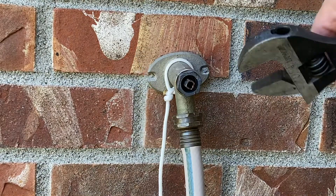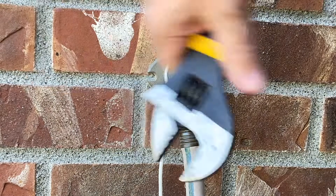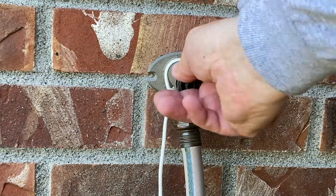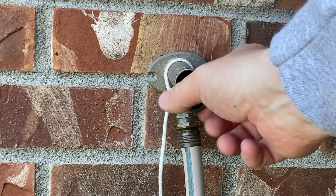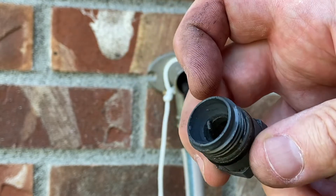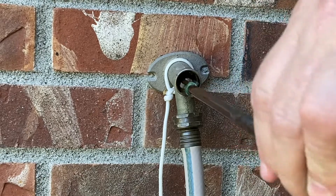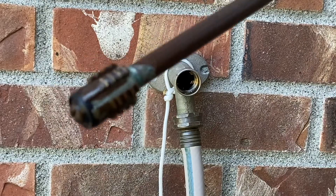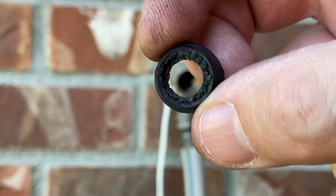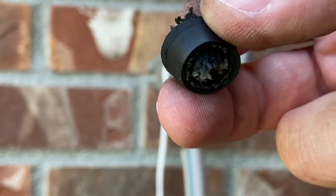I'll just turn this on and grab our adjustable jaw wrench — remember, all the way to the back — and get this piece off. This is a generic hose bib with no labeling on it. I don't know who makes it at all, which is a real bummer, so this part could be kind of hard to find. It's not a traditional style of packing. You can see it's concave down in there and it's just like a cone washer that fits down in there. Pull this out — you can see it's like a cone washer. We're going to take this whole piece up to the store. I only need the cone washer but I want to make sure I get the right size. You can see the inside of it is eaten up pretty good; it's starting to show the fabric. So we're going to get a new one. It's like a half-packing, half-washer setup.